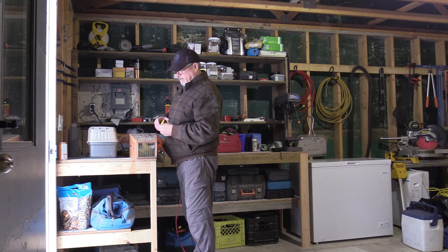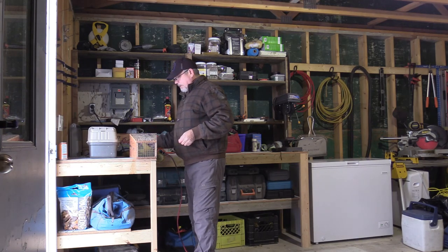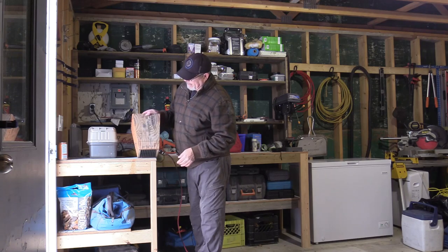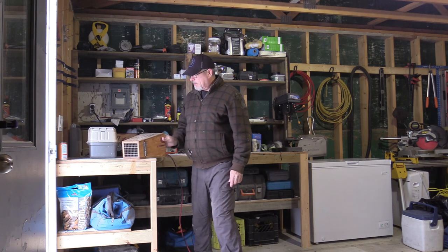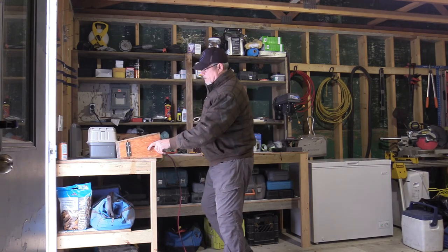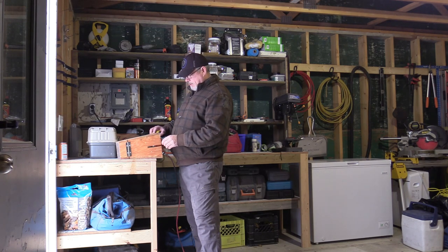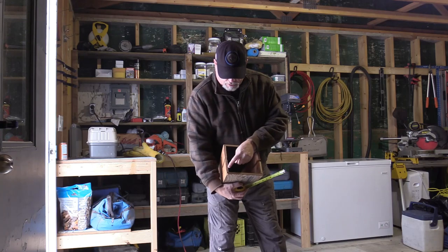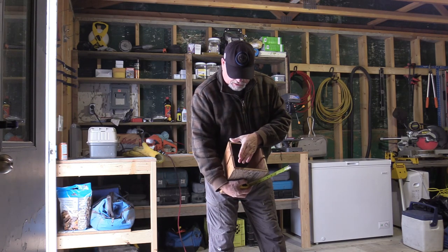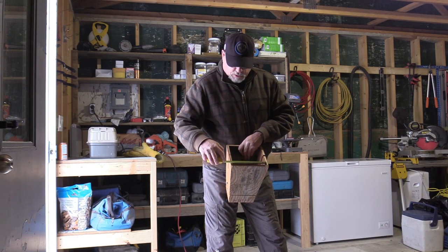We have the length of the box now and they're just about 12 inches. It's not important the exact length there, but what you're trying to do is not waste any of the plywood — that's for sure. So now we're going to figure out what we need. We're going to measure the outside here because we need ours longer because we're using three-quarter, since the inside board is half-inch. That's not going to change when we make it with our three-quarter. So pretty simple.